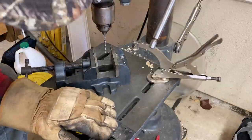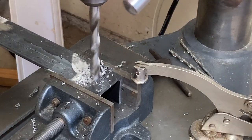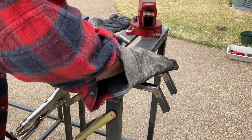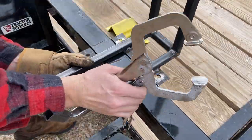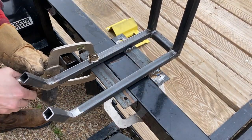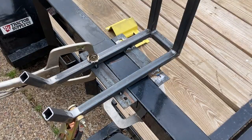I'm going to cut a seven-and-a-half-inch piece of angle iron — this is one-and-a-half-inch angle iron. I couldn't find my step bit, but this is a three-eighth-inch hole, and you'll do two of those that are three-quarter inches from the side. Four-and-a-half inches from the back, you'll weld that on — this is going to be the beginning of the bracket. Then take another piece cut the same way, and I just clamp it here because I wanted it really tight. I'll tack that in place. These are three-eighth-inch holes, and when you pull this off it's actually going to be really snug — it'll get even more snug when we paint it.